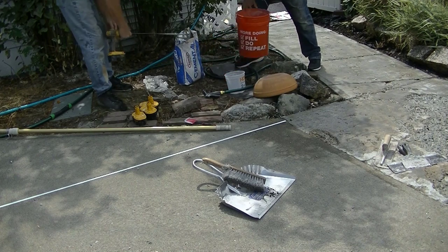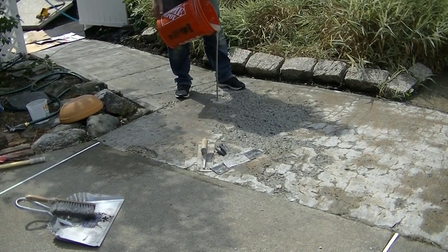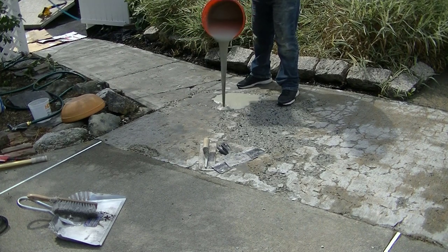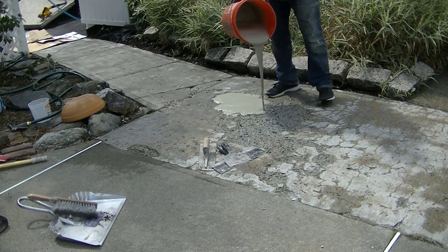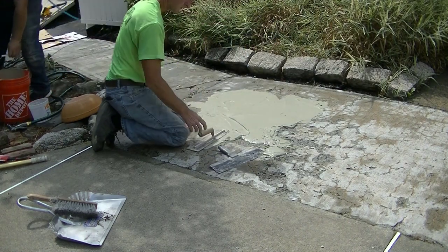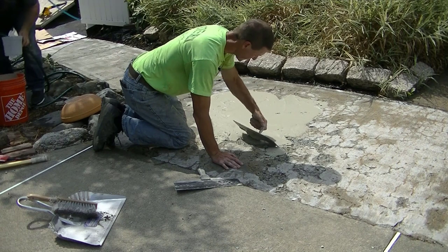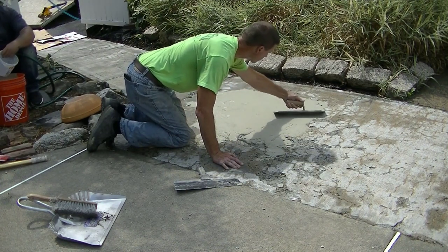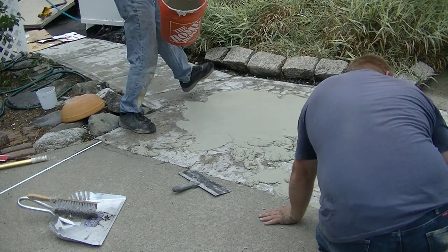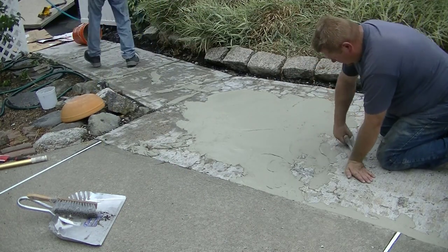So I'm just going to give you a little follow-up of what we did here. This thing was spalled quite bad — it had some cracks in it. The homeowner has a pool deck that we're going to eventually resurface, and that video will be coming up. She knew she was going to resurface everything and make it all look brand new, but this is all she had in the budget for this year. She didn't have enough money to replace it and just wanted it to look better. This piece was done a long, long time ago — probably 30 or 40 years ago — and it was beginning to be a trip hazard. So we said we can fix it, resurface it with our resurfacing product, seal it, coat it, and waterproof it so water won't get back in and damage it again.